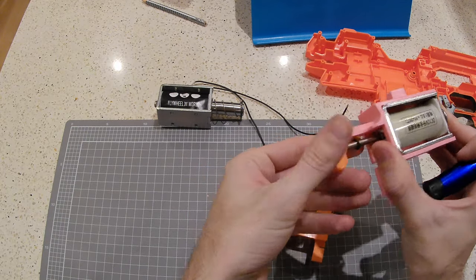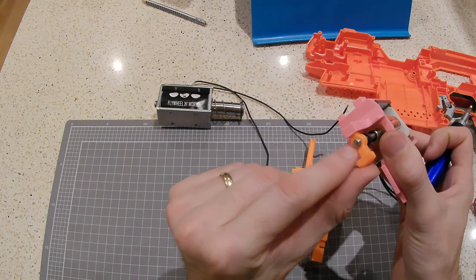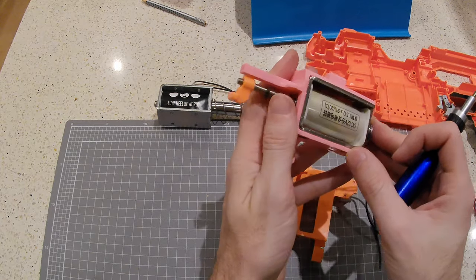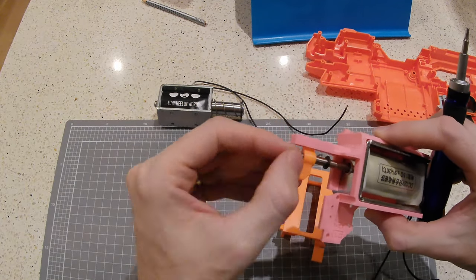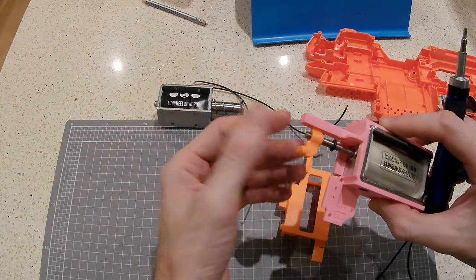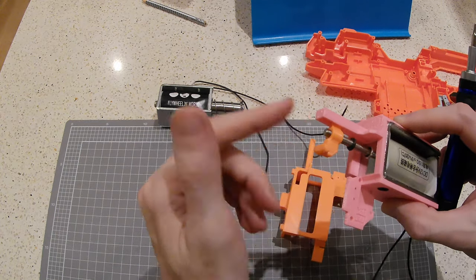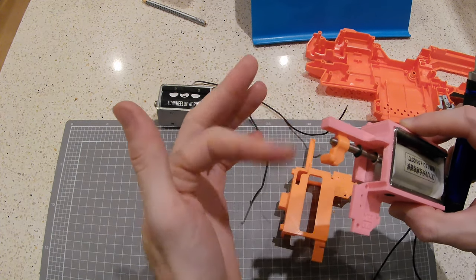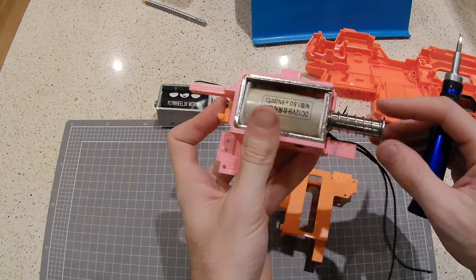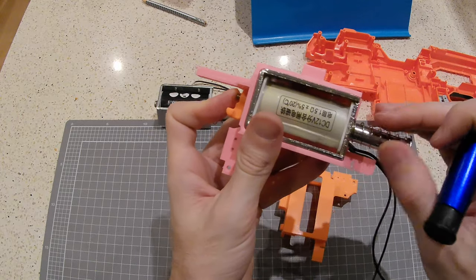The actual nub — you print this out and just thread it down. It's got an M4 thread in it so you just thread it in. With the 35mm solenoid you actually have to take the two nuts that are on it off before you can do anything — you'll need a vise or something like that to get them off since they're sort of thread-locked on. Crack it off, clean the threads — no problems. Keep this here, it's quite good. Change the spring while you're at it because the stock spring in these is terrible.